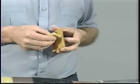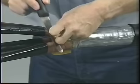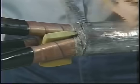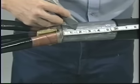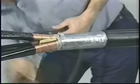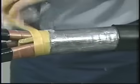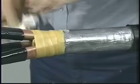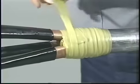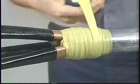Next, assemble the SRM insert perpendicularly and position between the phases as close to the lead cutback as possible. Trim the insert to extend only one-eighth of an inch beyond each phase, being careful not to damage the oil barrier tubes. Abrade and clean the lead sheath and mark it at one and one-half inches from the lead sheath cutback. Gently heat the SRM insert and adjacent oil barrier tubes for a proper oil seal. Stretch a long strip of stress relief mastic to one-half of its original width. Tightly wrap the SRM so it covers the area from the mark on the lead sheath to the outer edge of the SRM insert. Four to six strips of SRM should be used to build the oil seal to an appropriate diameter. The finished SRM diameter should not exceed that of the breakout installed in the next step.